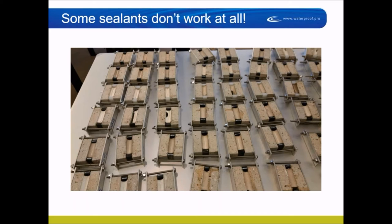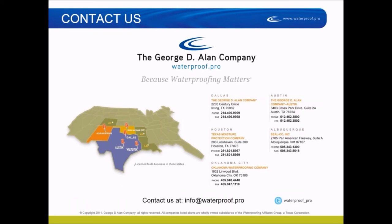You want to pick the best sealant and the best joint configuration because sealants are going to perform poorly regardless. When a manufacturer suggests something we know is bad, we tell them we don't recommend it, or we tell the customer we won't warranty it — let the manufacturer's warranty stand. Some manufacturers have come up to our roof to see the test samples and said, 'try our NP-100,' or 'we've reformulated.' Some have said they don't believe the test and that we did it wrong — the faulty test. The independent chemist in Michigan who conducts our testing says the lab conditions are so close to field conditions that the results are essentially equivalent. That's all he does — make samples and test them, years and years.